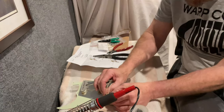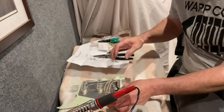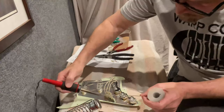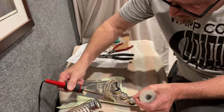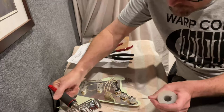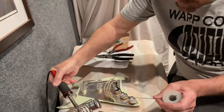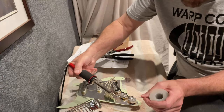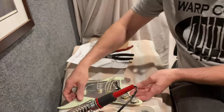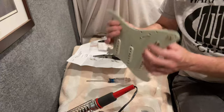Notice what I'm doing here — keeping it nice and clean and tight. Clean your solder tip periodically. I'm noticing a little bit of a green buildup on there. It's not the best quality solder I'm using, unfortunately — it's just really, really old.